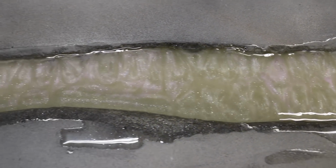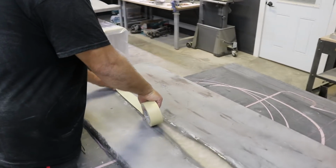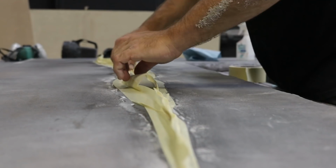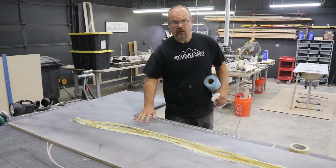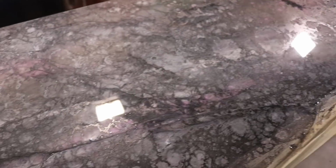I cleaned this with 91% isopropyl alcohol, and then I masked off this pearl inlay. I wanted to do that so I don't get anything on it on this coat. I was considering kind of overlaying the whole thing to match, but I love the way that looks so much. I don't want to mess with it. I'll just do a clear over both color coats after they're both set up. I'll come back after a few hours after the color coat has set up, just like I did in this piece over here. If you haven't seen the video on how we finished this one off, go check that out. I'll link that in the description. But this is the same idea. We've taped this off. We're going to keep this untouched. The rest of it we're going to color coat, then we'll peel that off and feather it together.